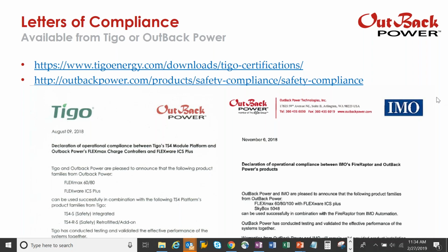All right, so from Christopher Warfel, is the ICS box any smaller than the one made before the module level shutdown was required? No, Christopher, it is the same size with fewer components inside. We have considered integrating sort of a string level AFCI solution or something like that to allow for smaller AFCI solutions on the roof, but the issue there is the cost really goes up. So it's the same size, same enclosure, but lower cost because of the reduction in expensive components, which are now essentially built into the functionality of the FM100's hardware and firmware.